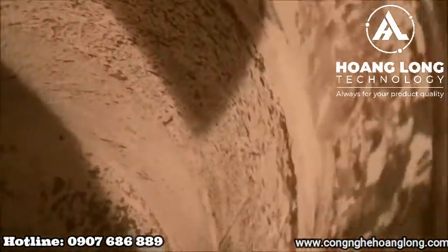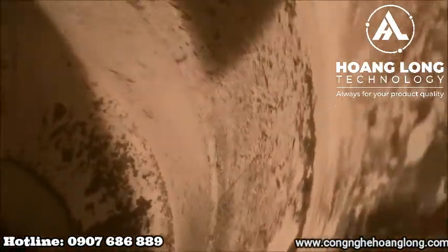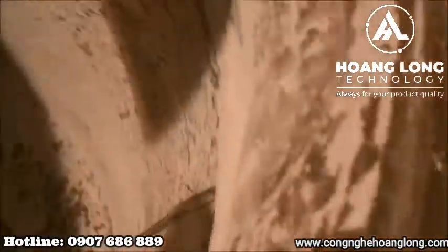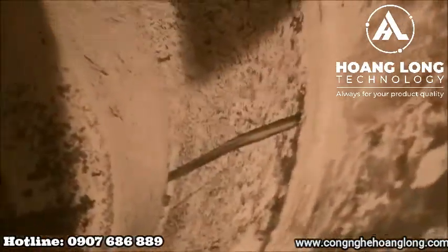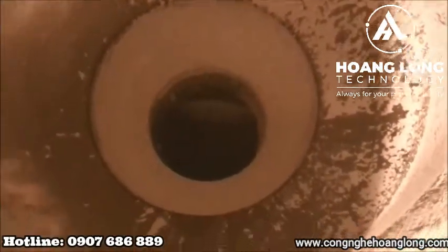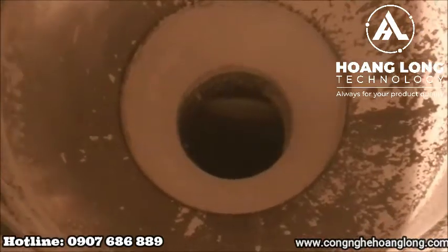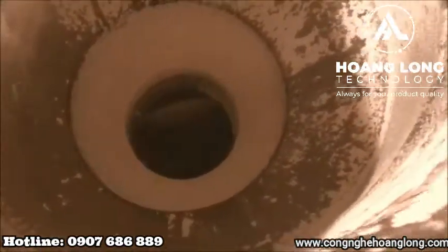The inside of the PIAB, there is a little bit of product on the walls of the PIAB, to be expected, since the calcium carbonate does have some sticky properties to it. But as you can see, it releases right off the wall. Nothing permanently stuck there. So you have the discharge there, product discharge down the bottom. There's a slight coating on the fluidization cone. Cone is white itself too.